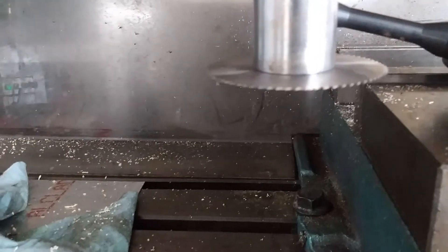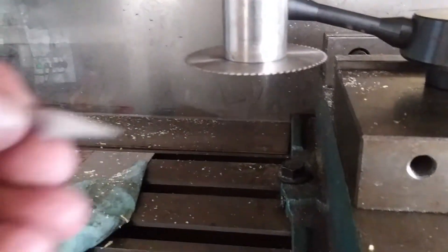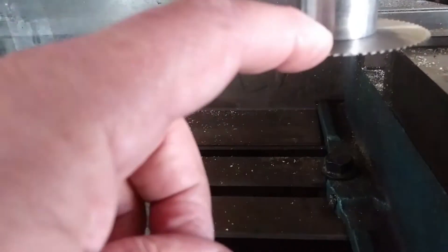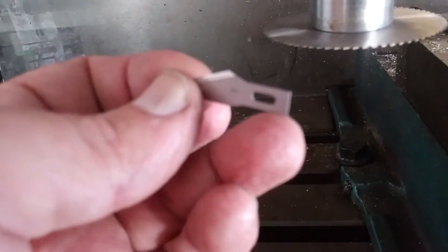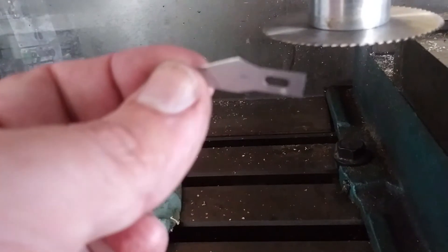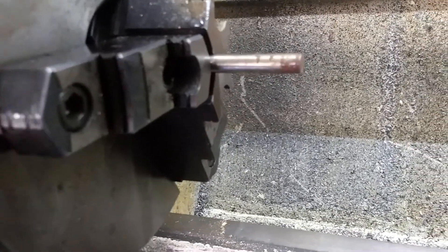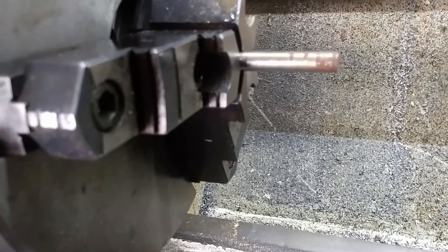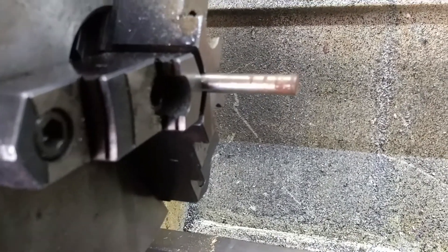The slit is going to accept an X-Acto knife blade, which is 20 thousandths thick. That slitting saw is also 20 thousandths thick. The standard size of the back piece of an X-Acto blade that slides into the knife body is quarter inch, so it actually already slides into the soldering iron. Basically all I'm doing is making a little adapter with a slit in it that slides into the soldering iron, and then the blade slides in and I tighten the set screw — hopefully it pinches tight enough to transfer the heat into the blade.